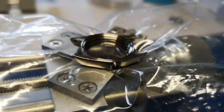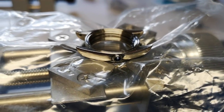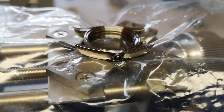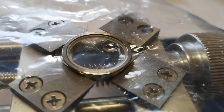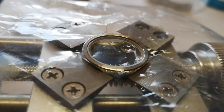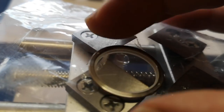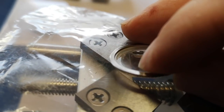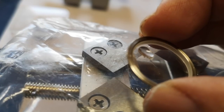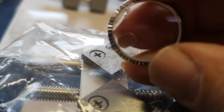So there's the little Rolex case on the bezel removing tool. All we've got to do is turn the knob and those wedges will get between the bezel and the case and gracefully lift it away. And here is the tool having done its job — the main case has come away, leaving the bezel, the glass crystal, and the crystal gasket as sort of one component. This is a fairly straightforward release.